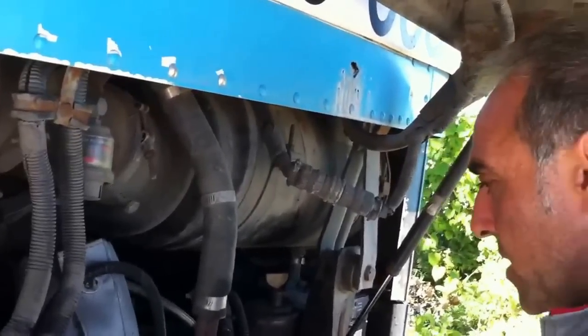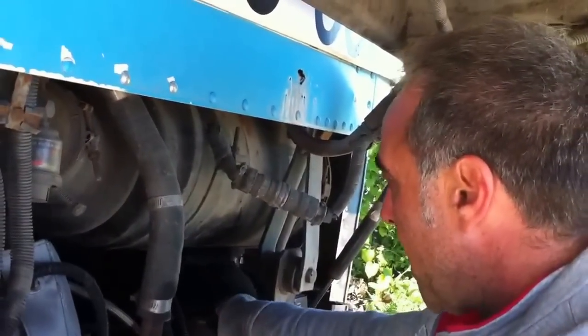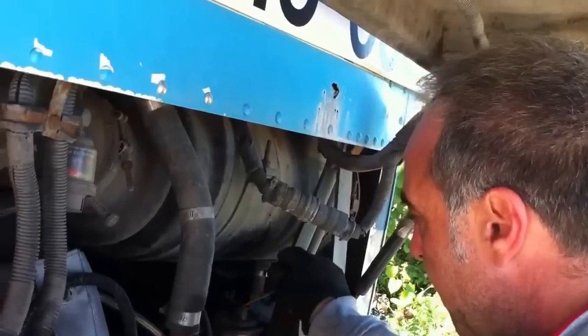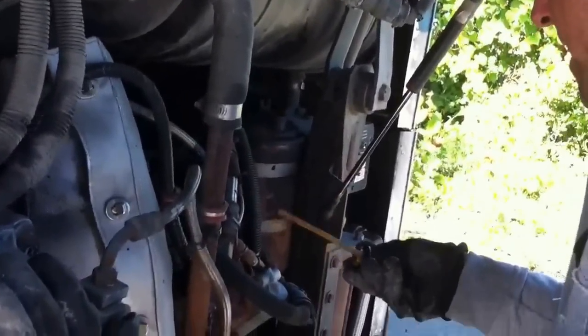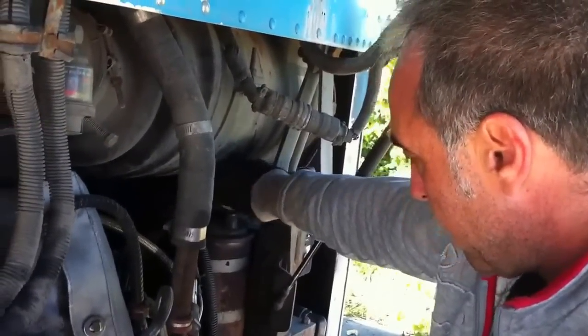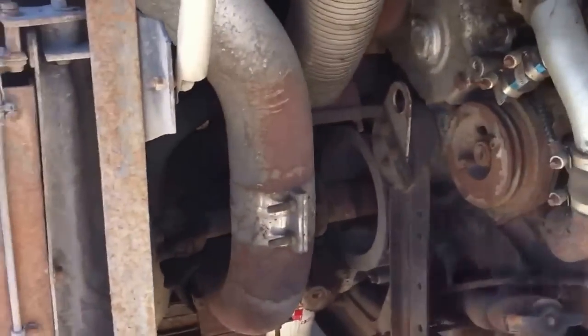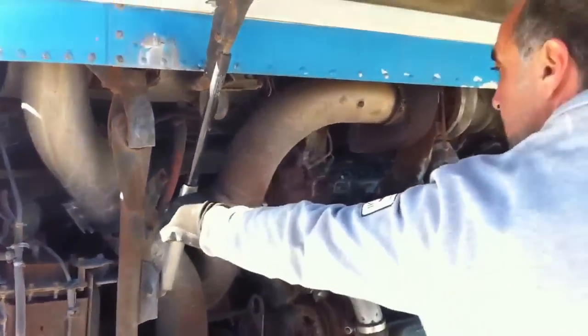The compressor is solid. If the compressor is loose to the point of breakaway, that will be a major defect. Our power steering fluid must be at the recommended level, and it is. If it is below the recommended level, this would be a minor defect. All engine components seem to be solid. If not, we will repair before going out on the road.